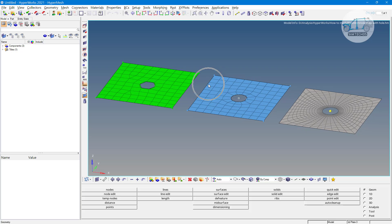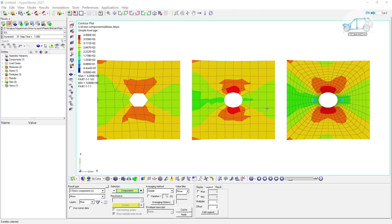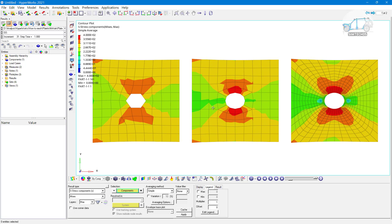But if I am trying to apply a bending load on this plate, the hole is not captured by the element, so we are completely ignoring that meshing. If I apply the bending load on this component, then there is no meaning of such precise meshing near the hole. I already know when I apply the bending load, the region is held or clamped by something else. Let me show you the results. We have three cases: the first is a coarse mesh, the second has an appropriate number of elements near the hole.